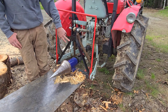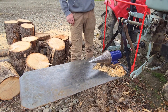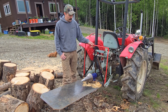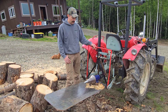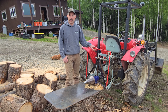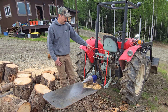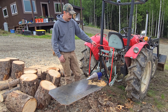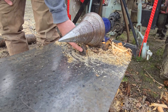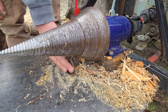I built the rest of this framework myself. This was like an old three-point hitch adapter that I used, got some flat plate steel — just scrap steel I had laying around — and welded it up. This is the safety shutoff bar; I have this pair of cords going to the shutoff on the tractor, so if anything gets wrapped up in the screw you can just pull the bar and it shuts the tractor off. I also welded a little stop underneath to prevent wood from getting sideways, jammed under there, and potentially bending the shaft.